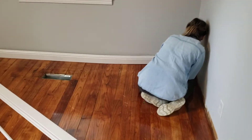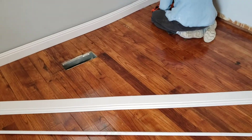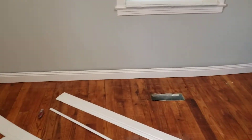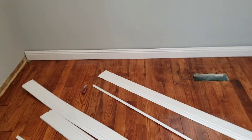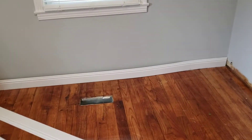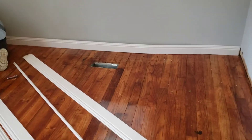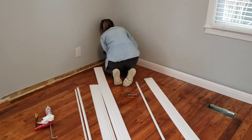I've got the first piece cut for Jane. She's using a Paslode finish nailer — it's loud, so she needs ear protection. She's going to do both her ends first and then nail the middle, because there's a slight bow in the wall. While she's doing that, I'm going to take the second measurement, go cut it, and grab her ear protection.